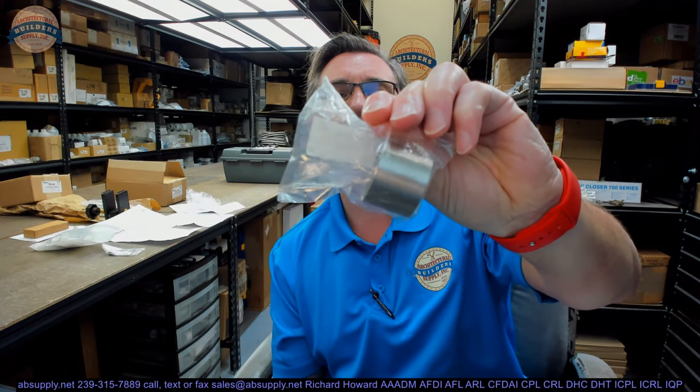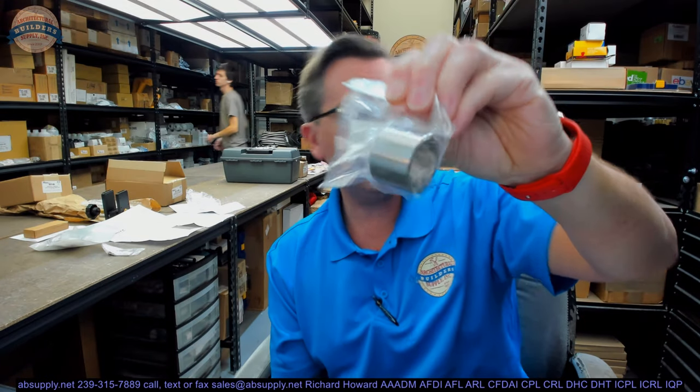In conclusion, this is a very typical sort of item you are going to need — the 3/32nds is very common. They go out to about five-eighths of an inch. Be mindful: if you need a collar thickness not within what Kaba offers, reach out to us — we can definitely make special length collars. Here is one that is an inch and a sixteenth. You can also stack them together if you need to in a pinch, because a custom cylinder collar will take some lead time.